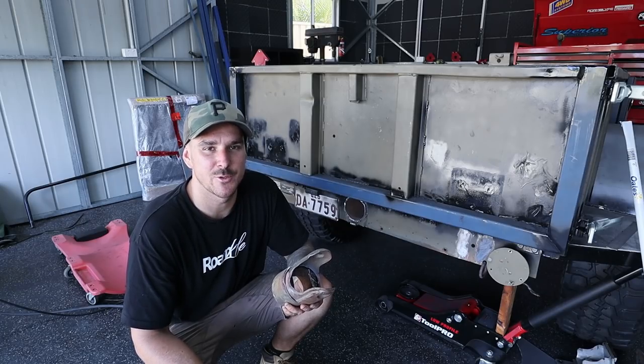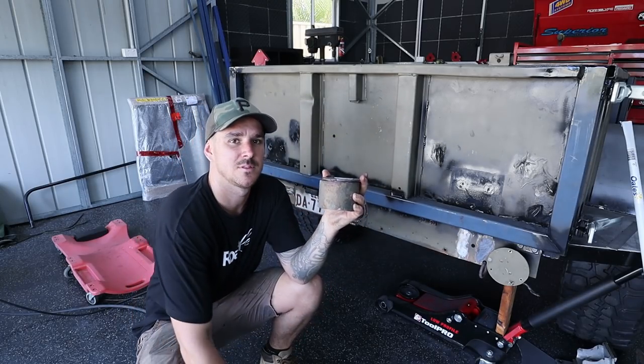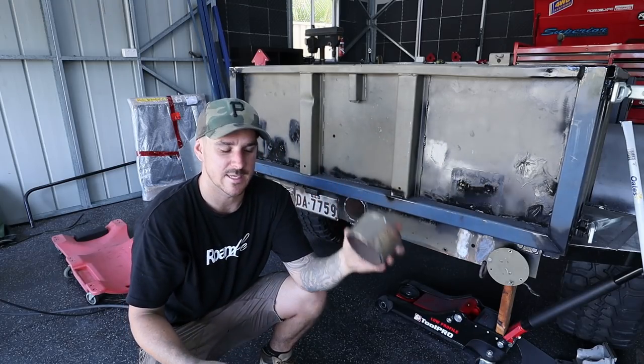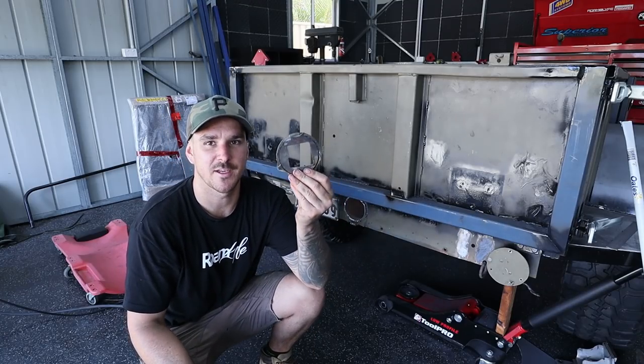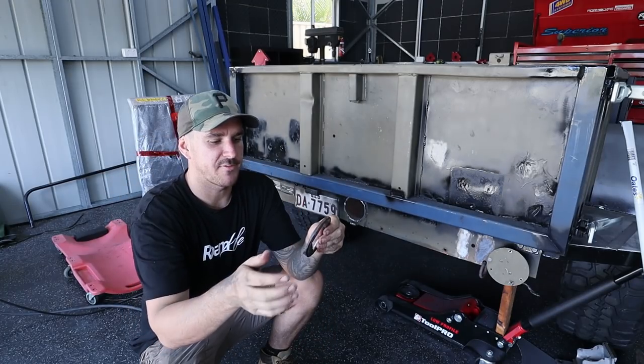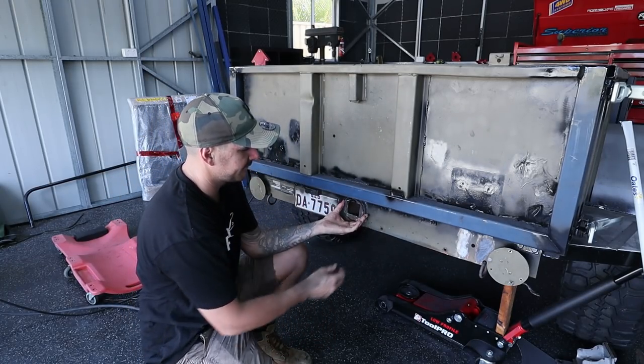Right, so that just took me literally about an hour to get to this point, but we had our pintle hitch. I cut it. I then cut it again to get the center out because it was actually a welded center in there. Then I've cut a square in this. This is now what I was chasing out of the actual pintle hitch. So I flap that back, I cut a square in it. Now that is gonna go like that onto the back.